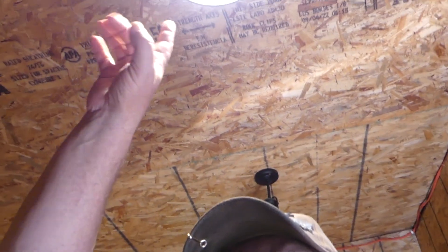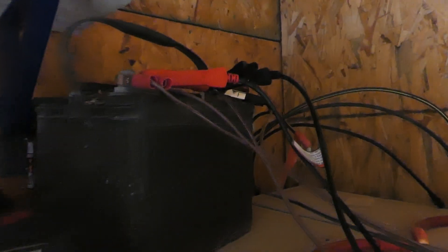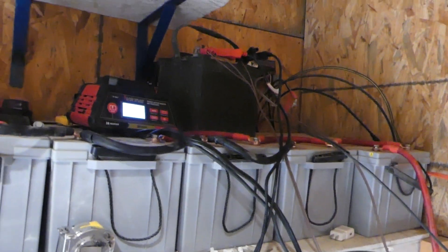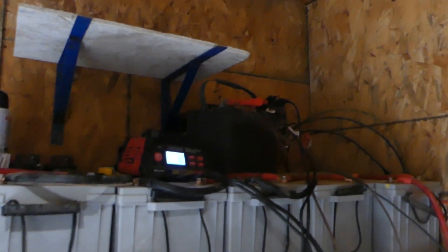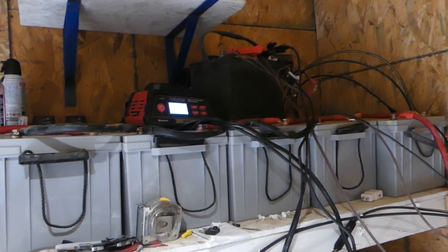I also have a battery charger charging the battery, because when I went to the 48 volt system I couldn't have any of my old stuff plugged in. My lights here are 12 volt, and the solar tracker controls are also 12 volt, so I had to hook them to a separate battery. Now that I got it all set up, I have to set up one of my charge controllers to keep that battery charged, so I had to run a little small separate solar system for that.